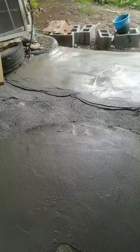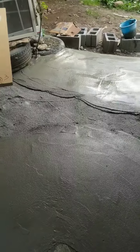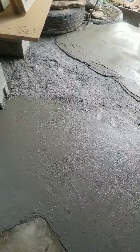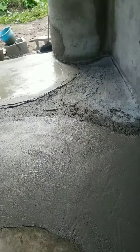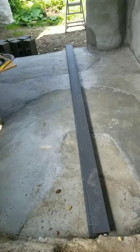It's close to level, but it's got a little ways to go still. Once all of this dries, probably by tomorrow it'll be okay to walk on, and then you can fill in those gaps. The mortar dries and becomes hard enough to walk on a lot faster than the aircrete. So hopefully by tomorrow, or in the next couple days anyways, we'll probably be able to fill those in.